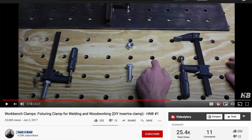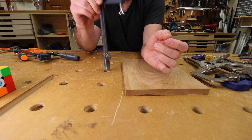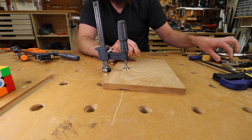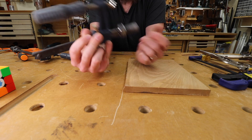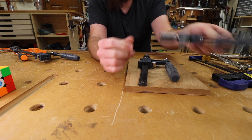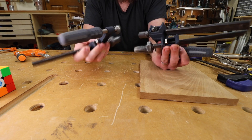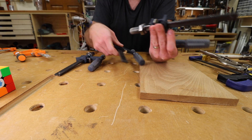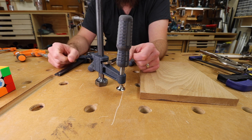I found a video — I'll put a link below — where a guy was welding bolts onto the bottom of these Harbor Freight bar clamps. This is the design I think is just awesome. It has great clamping pressure, one-handed operation. I made a few versions: this one has a ¾ inch bolt, this one has a ¾ inch solid steel rod, and this one has a 20mm bolt. My conclusion is they all work, but I'd prefer the 20mm bolt with the threads cut off. Second choice would be the ¾ inch solid steel rod. I would definitely advise against using threaded parts because they're just going to tear up the hole.